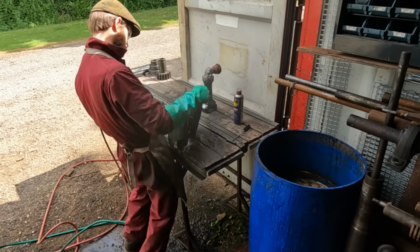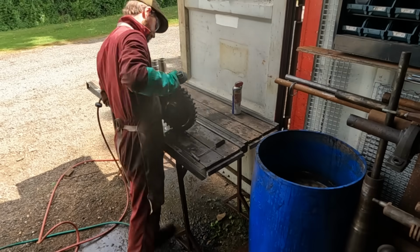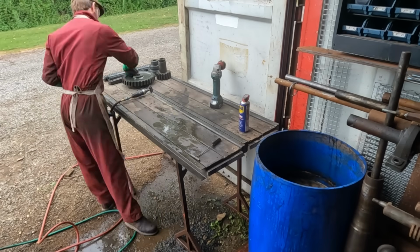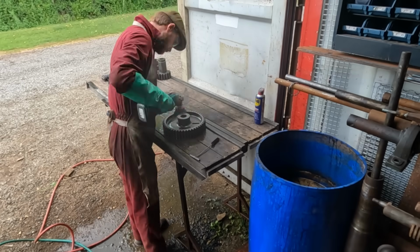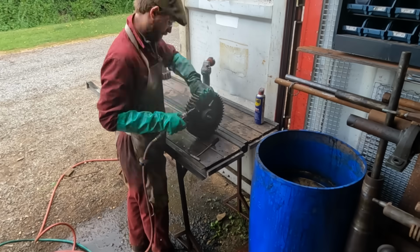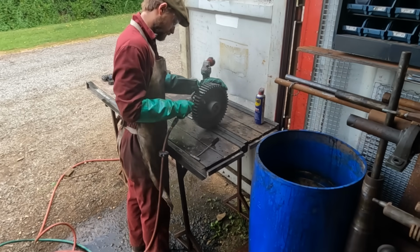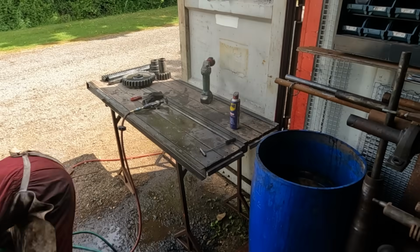You can submerge freshly cleaned parts in clean water to isolate them from oxygen in the air, and there are also additives available to add to said bath which prevent the flash rusting. This is only really handy if you plan to paint parts after derusting and so don't want them covered in oil. Once I've built up an amount of clean parts, I'll coat them all in machine oil, which will protect them enough on the shelf until we get round to reassembling them back on the machine.